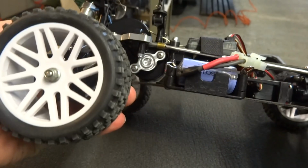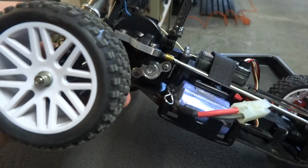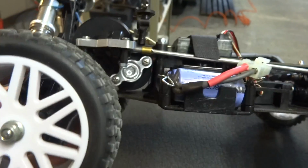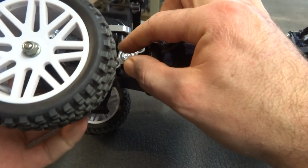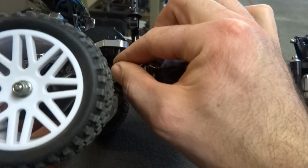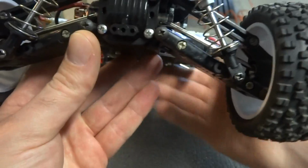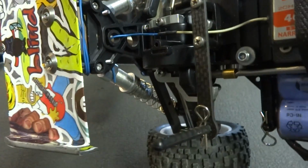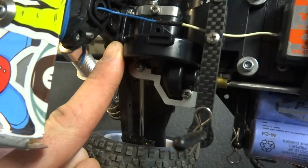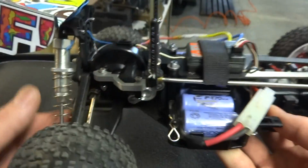There is also a motor plate to spread the force onto a bigger area. You see this? And everywhere where I have enough place, I went through the whole plastic sections and put nuts everywhere where possible. On the backside also, I go with metric M3 nuts and bolts all the way through. You can see here there is also a nut, but here there is not enough space, so you need to go with a countersunk head, so you can put this afterwards on the gearbox.